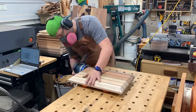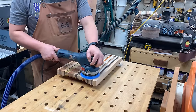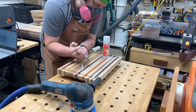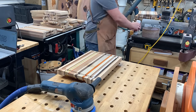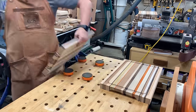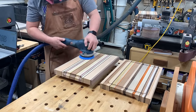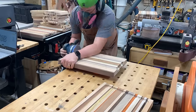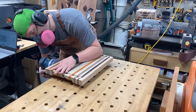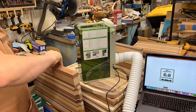For sanding, I always start with 80 grit. Yes, I have a drum sander, but there are so many sanding lines I still use the random orbital sander at 80 grit to clean up all the sides — top, bottom, and all the edges. If you have little bug holes or voids, you can fill those with epoxy or CA glue with activator. I'm not touching the edges yet at this stage because I still need to do some router profiles, but this ensures clean surfaces for the router work later.